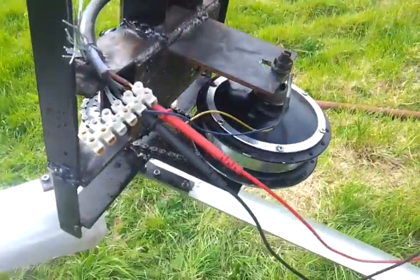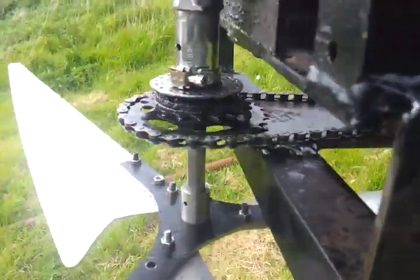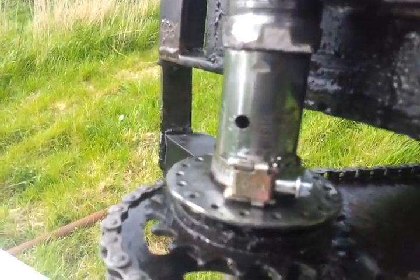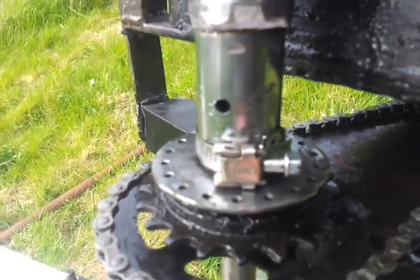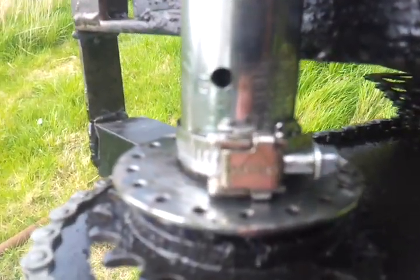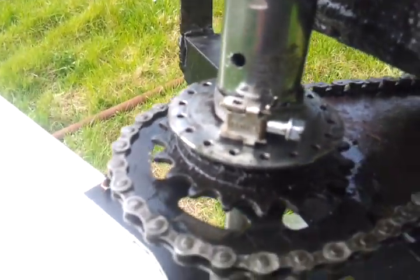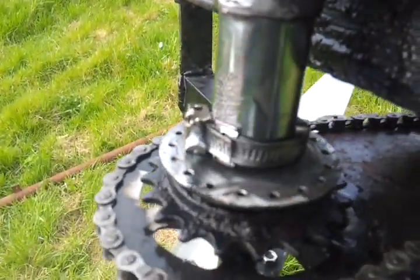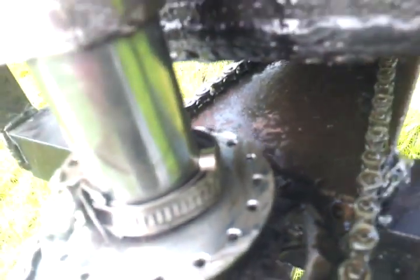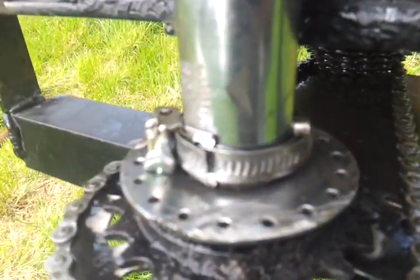I've shown you the basics of the gears. That took a lot of bodging because I didn't have the right kind of sprocket, so I had to use a rear bike sprocket from an old electric bike I had. But the tooth chain wasn't the right size. I thought I'd cracked it — I've got it bodged on, it's got a keyway of sorts cut inside there, and basically we've got a titanium bolt around this side from a set of handlebars.